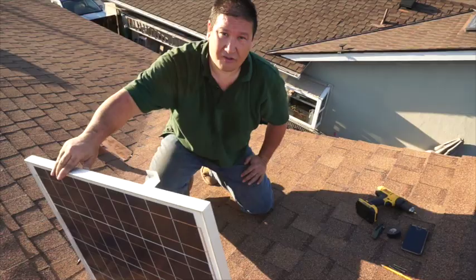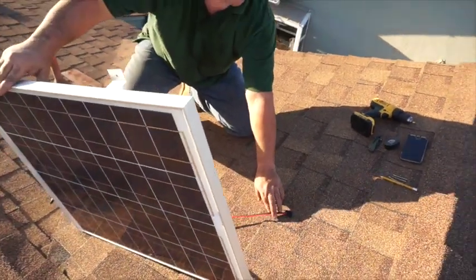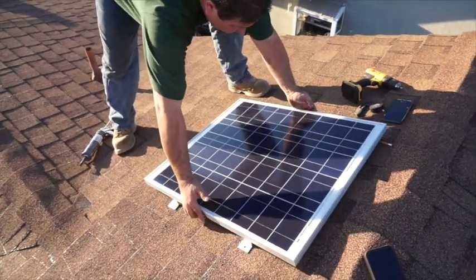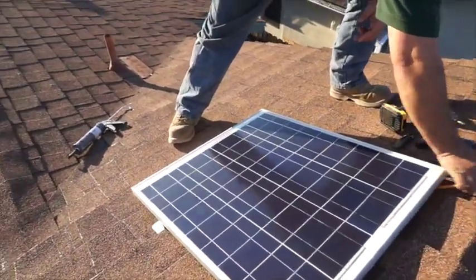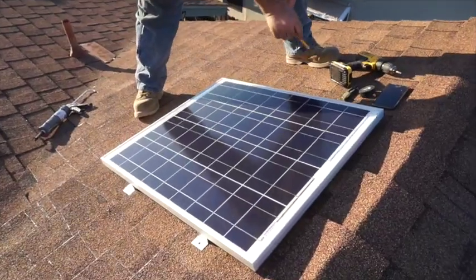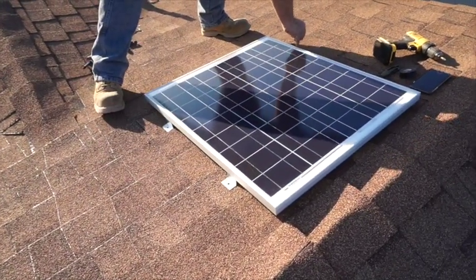We're ready to install the solar panel. We took the line through the roof and put some roof tar — you want to make sure you don't have any leaks. Go around the wire and wiggle it in and out so enough is going through the hole. You want to place your solar panel as high up on the roof edge as you can, because you want to catch the late afternoon and end of evening sun. That's when your attic is going to want to be cooling down before you go into the night to lower your cooling costs. Take a pencil and mark your Z brackets so you know where you're going to install it to the roof.